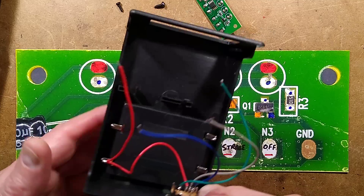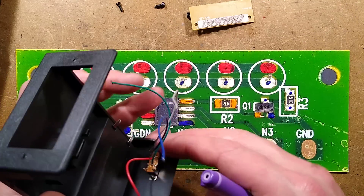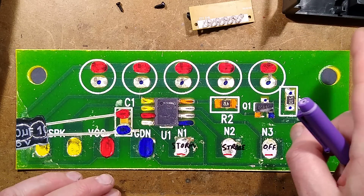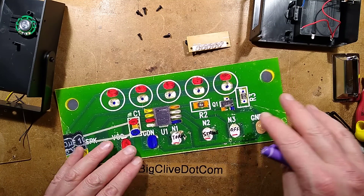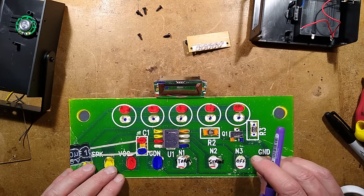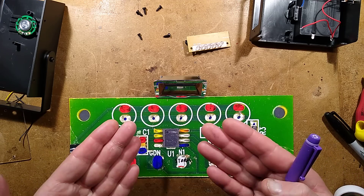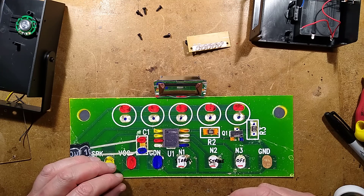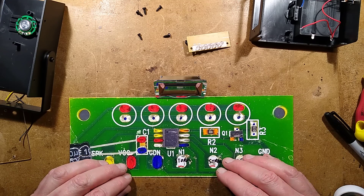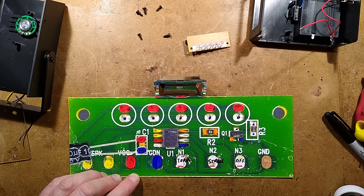But the case is nice. The case has the battery pack built in, it's got a switch built in, and it's got the LED and reflector assembly just like a usual little strobe light. So it does have hackability. In the past I have hacked these — I've used them for garden lighting by putting green LEDs into the reflector and just having it light up when you turn the switch on, with a resistor. It makes a nice little spotlight in the garden. This isn't something I'd recommend as-is — get it for the case, it's a nice case. But the circuitry and the effect itself is not that pleasant — it's just a little bit irritating. The novelty will wear off and you will turn it off. But as I say, nice case — worth getting just for the case.